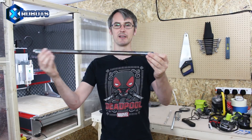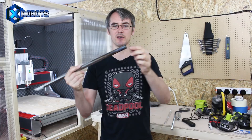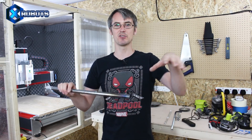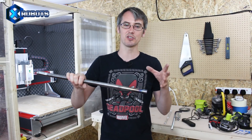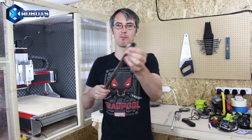So I think I need to work on my fire. This is the tube I was using for blowing. I think what I need to do is block the end up, drill lots of holes in the top there so we don't just get one big blast of air that makes the fire hot in one place and burns the coal really quick and everything falls into it. Probably need to disperse the air through the sand, get the fire hot all over. Then we really can put metal into the hot coals and the hot ashes at the bottom - that's where it's the hottest, without blowing loads of air at it and cooling it down, which is a problem I had to start with.